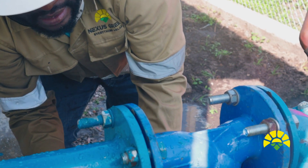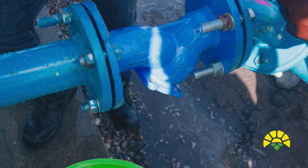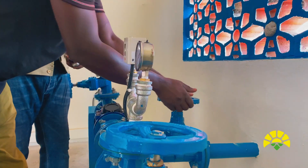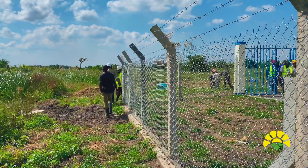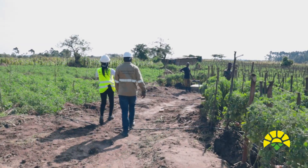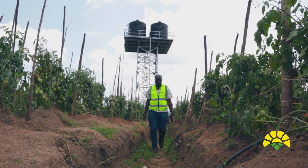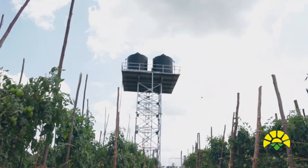When you are washing the strainer, you can use a simple brush for scrubbing and cleaning. In case anything beyond the strainer level passes through, you capture it at the reservoir filter, which cleans it up and prepares it for irrigation. This is the main gate valve — it has valves from the main line and valves to the sub-main. The main line comes from the tank and distributes water to the sub-mains, which then take water to the blocks from which the laterals tap off.